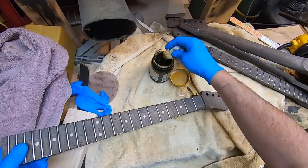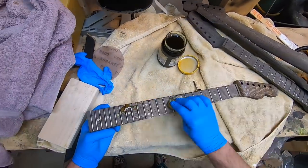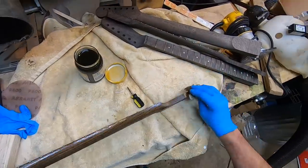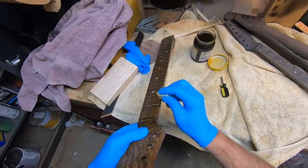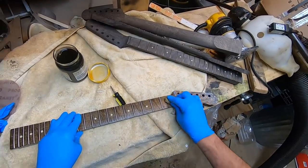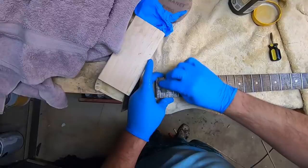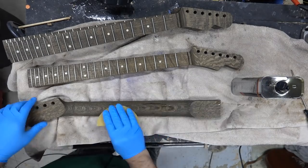So then I've got a special finishing solution that dries these necks relatively hard for a wipe on. This is a varnish that I'll apply two coats on, let it really soak into the wood, and then wipe it off. My can was breaking, so I poured it in the two little cans. Just a standard urethane wipe on. I'll let this dry. I'll put two coats on. I let these necks sit then for about 2 weeks to really allow that varnish to dry up.